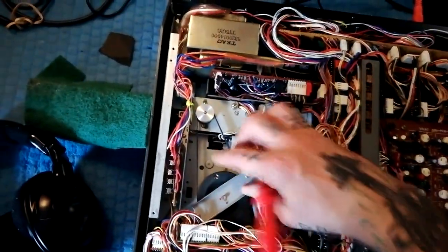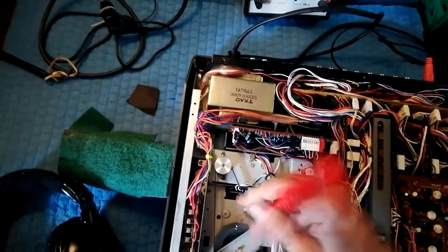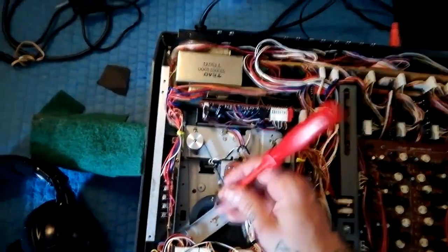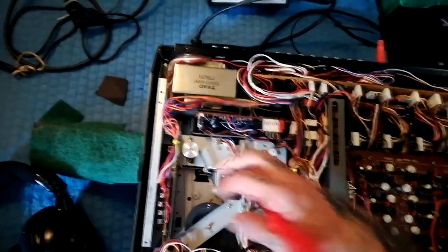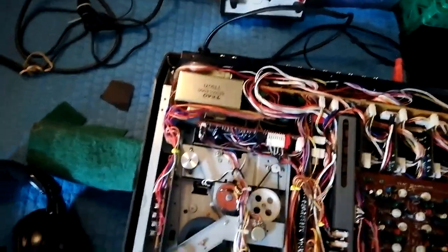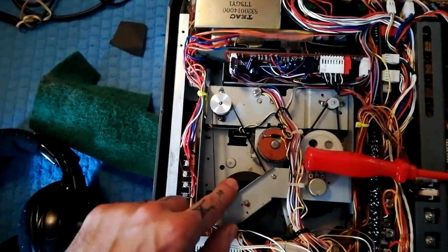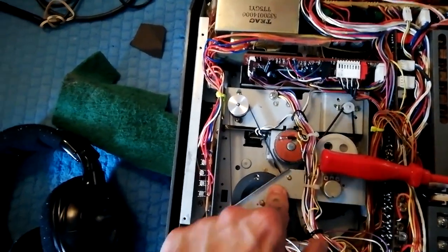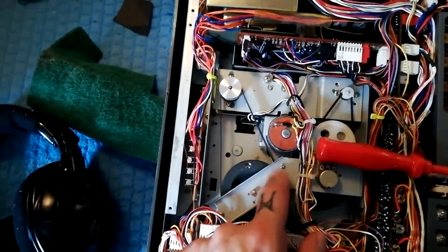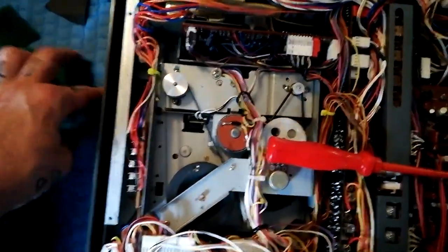If I tighten this, that's probably still just about okay. If I tighten it a bit more — at that point I can't get it to click and move. That's too much. So you want it to have a tiny amount of give, but you obviously don't want too much leeway. If it's too loose, what can start to happen is the top surface of the flywheel will touch that thrust plate — or if, due to heat, being dropped, or whatever, that plate is a little bit warped, then that can happen.